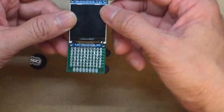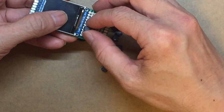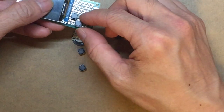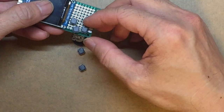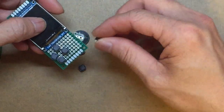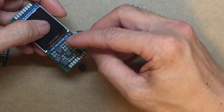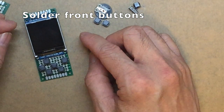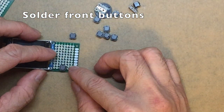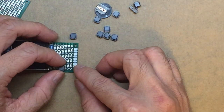First let's do some fitting. We insert the TFT on the top row of the perfboard and then try to fit in all the buttons. Make sure everything still fits and that you can operate the buttons without accidentally hitting other buttons. Once you're satisfied with the location of the buttons, you can solder them on the top of the perfboard. Because this perfboard is double-sided, you can solder on the top and it will be connected to the bottom, so you don't need to add another wire to pass through the perfboard.